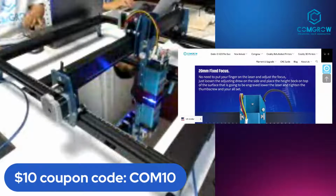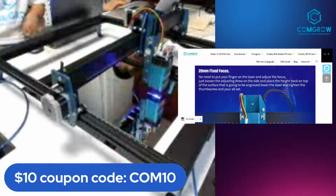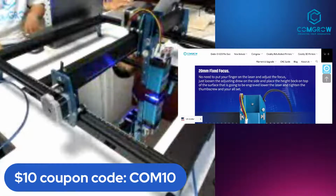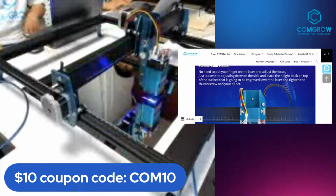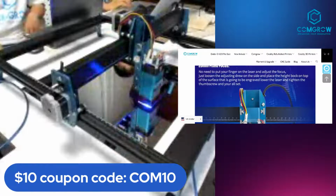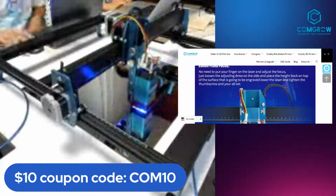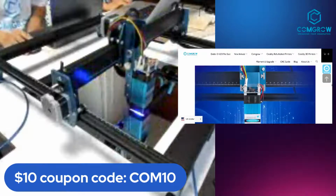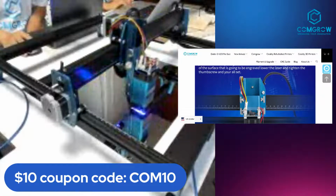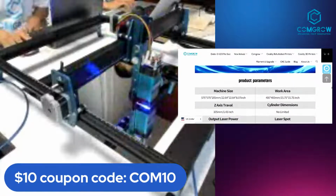And also, I think you are always concerned about the laser itself. What we use here is a 20-millimeter fixed focus. So there is no need to put your finger on the laser and adjust focus. Just loosen the adjusting screw on the side, place the height block on top of the surface that is going to be engraved, lower the laser, and tighten the thumb screw, and you're all set. You can see here our laser head structure. It's pretty simple.